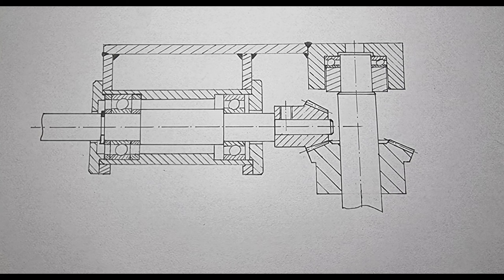Next up was the shaft. For that, let's take a look at my drawing once again. As you can see, on the right side I need to fit the small bevel gear and there are also the two bearing seats. On the left you can see the fixed bearing. If you look closely, there are four rings in total surrounding the bearing. The purpose of them is to provide some kind of adjustability for the bevel gears.